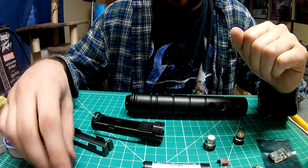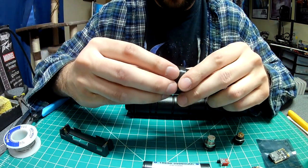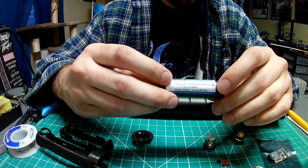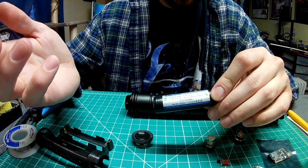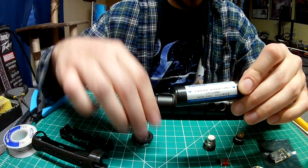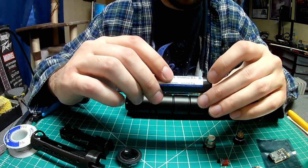Back to the parts overview: I have a 28mm KR Sabres bass speaker, which sinks in really well. I have our 18650 battery — I went with the 3500 milliamp battery because it still pumps out 10 amps, which will be enough to drive a fully lit NeoPixel blade even as white, which draws the most amperage at around 9.9 amps.